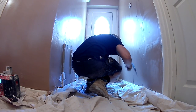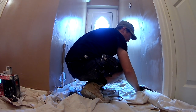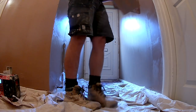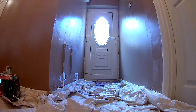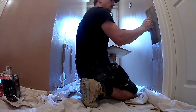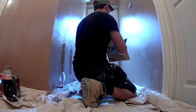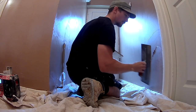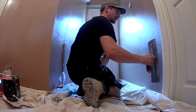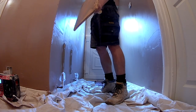I'm using the heel of my trowel to keep my skirting boards nice. If you are working near skirting boards, make sure you've got all the plaster on at the beginning — it's easy to miss some bits, especially if you're rushing. People will notice it; it's something that needs attention. Again working around the door — I've got masking tape to the architrave so you don't have to worry about cleaning anything later on. If you're starting out this is essential — you don't have to worry about keeping everything clean as you go or getting your sponge out to protect your woodwork. It's all been prepped and you don't have to worry about it.